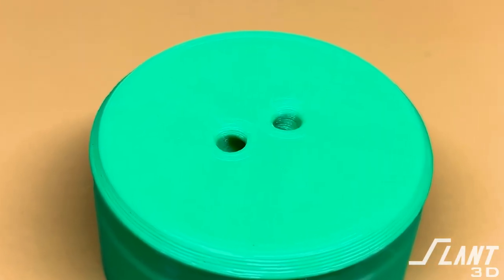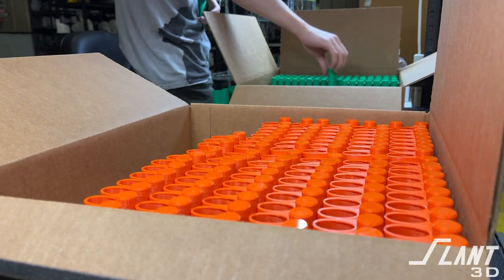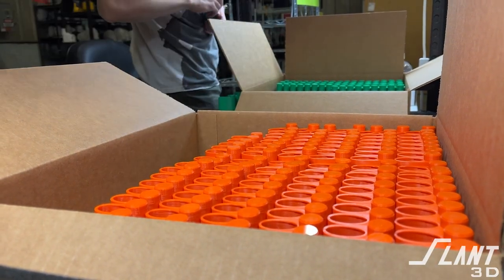This is probably one of the most difficult geometries to do with traditional manufacturing because it's actually an impossible geometry. The most basic option is to make sure loops are in-plane with the cap or object. Long term, you can move into more complex connectors that go around square containers, scale up to a full-size handle, or use impossible internal geometries that can't be done any other way. Mass production 3D printing can do this at the same scale and cost as basically any other process — but you have to design for it to take full advantage and create something completely new.